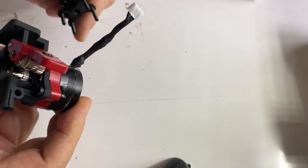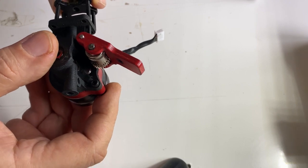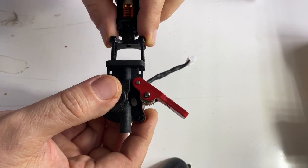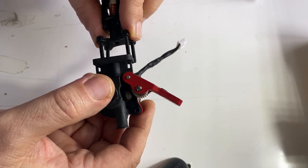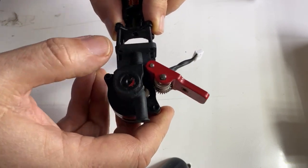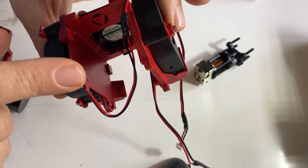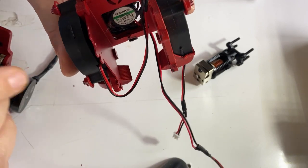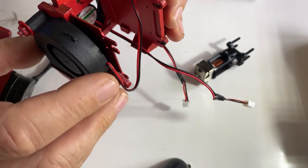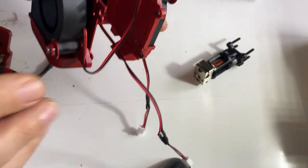Here's the way you should mount the extruder and the hot end. In between the hot end and extruder is the mount for the old E3D V6 on the bracket of the X-axis linear rail block. It is beneficial to mount it so that this part of the heat block is looking towards you. The fan mount and fan ducts are slid onto the old fan housing. The design permits the use of two radial fans type 5015 as part cooling fans, and one 4010 axial fan for the heat break cooling of the hot end.